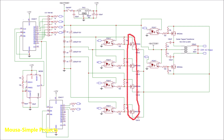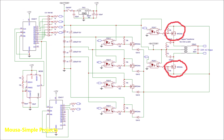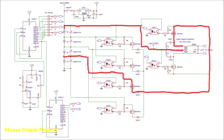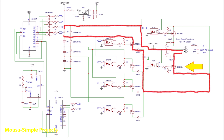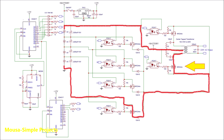So this is my circuit. I'm using these four MOSFETs as a selector switch. These 4017 ICs switch them on and off sequentially. The other two MOSFETs — one to create the positive cycle and the other to create the negative cycle of the waveform. At the beginning, the first MOSFET is switched on, so the voltage across the primary of the transformer will be 6 volts. Then the second MOSFET switches on so the voltage will be 12 volts, the third gives 18 volts, and the last one 24 volts. Then the same thing in reverse sequence for the negative cycle of the waveform.